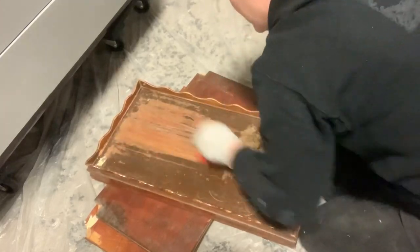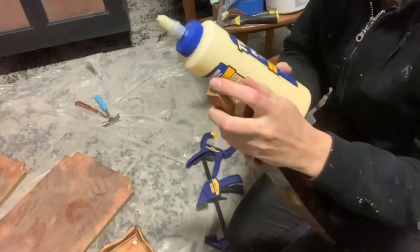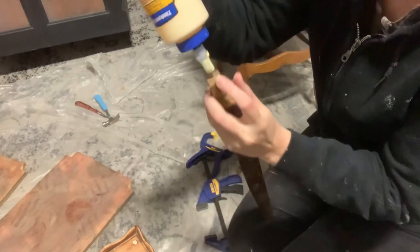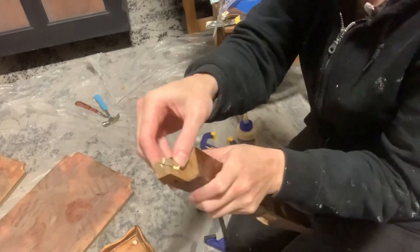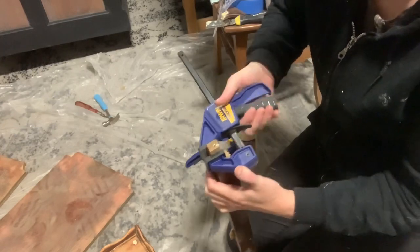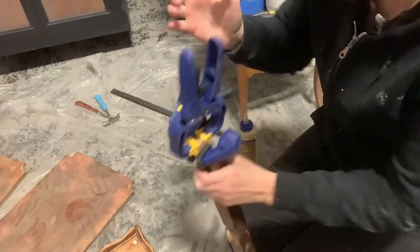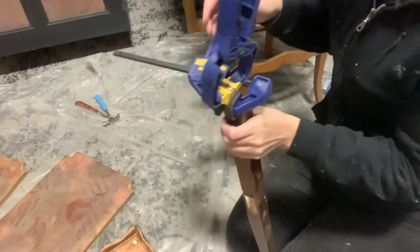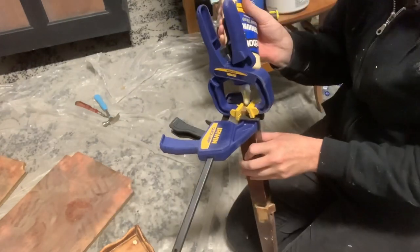This is one of my most favorite things — a paint scraper. I use it for finishes that are super damaged, just taking it off while it's apart because it'll be easier when it's not attached to the table. Here I showed you the splits in the top — we're going to repair those, so I'm getting some glue in there and clamping it up. I actually leave these overnight to make sure it's really solidly stuck. A fun fact: an actual glue joint is stronger than wood — I've done a test with that.